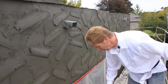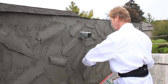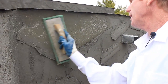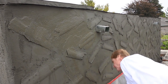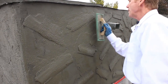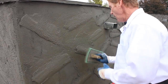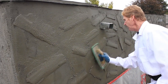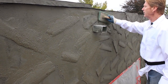Now after you've got your pattern on — there are a lot of ways to put that pattern on, guys. This has set too — we took a lunch break, it's set. Now you take water and just put it on and let it drip off. The idea is to soften it up a bit. Then we let this wall sit an hour, but if you let it sit a half hour that's about the right time. Since I let it sit so long I'm going to use a little bit more water. A lot of water will create a very sandy appearance; less water, less sand. You start from the top, add a lot of water, let it drip down the wall — that's okay.